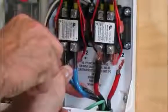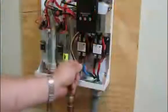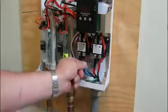To connect the wires, loosen the slot head terminal screws on the relay blocks. Power leads L1 and L2, typically colored red and black, connect to the appropriate terminals on each relay block. Tighten the terminal screws firmly and assure they are not loose.